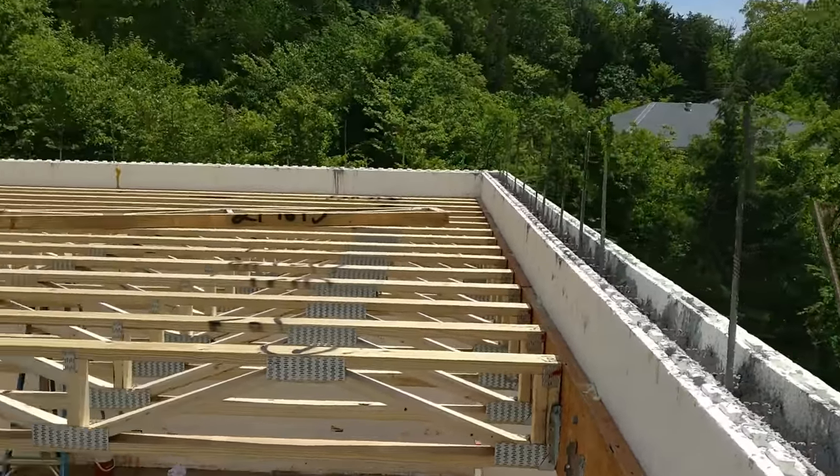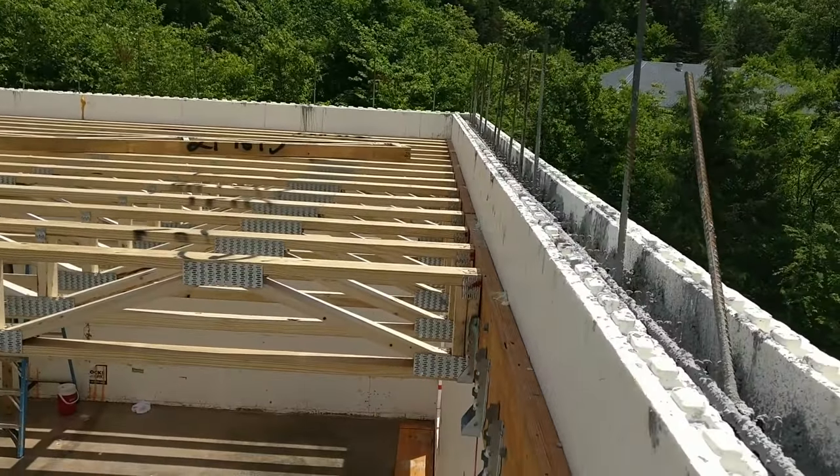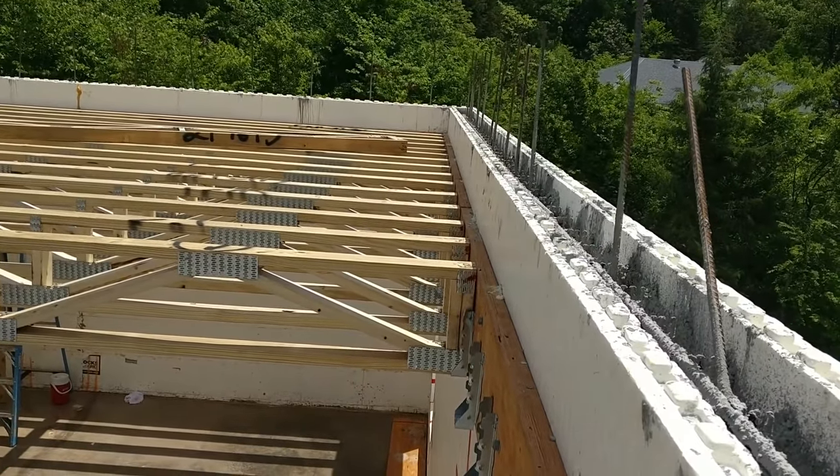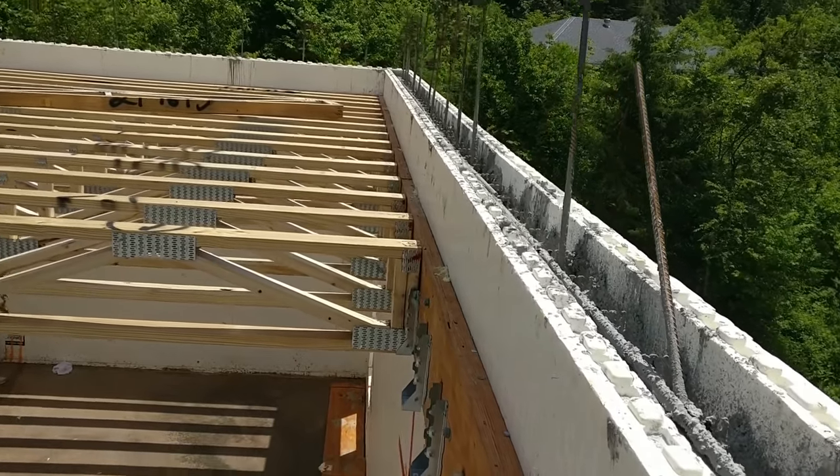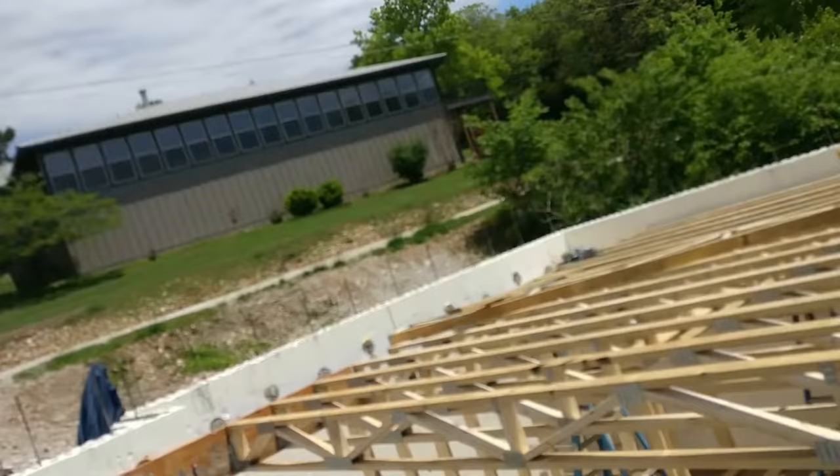Wow, that's amazing. I'm looking down the line here and it's just amazing how straight everything is lined up, because there's really not a margin of error for when you have this style of joists, right? Because you can't cut the ends of these — is that correct? Well, yes and no. If you made a mistake in your measurements, you can cut the end, but you have to get what they call a field fix — you have to get that engineered by the manufacturer.